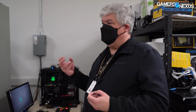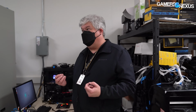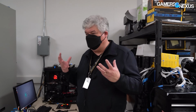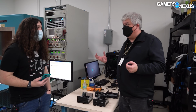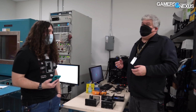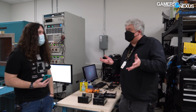What it is, you could take a good MOSFET, let's say like $1, and you could build a half bridge out of it, right? Or you could buy a cheap MOSFET that doesn't have the thermal resistance or thermal fortitude of the better one, and get it for 30 cents. But it can't even support 750 watt in a bridge, right? So what do you do? You just double it up. There's your full bridge. So for the wrong reason. So you spent less money, you've got full bridge, you're doing the same job. It kind of works.